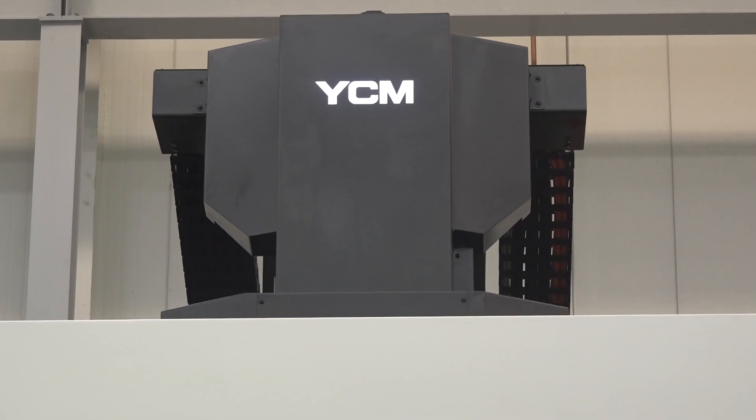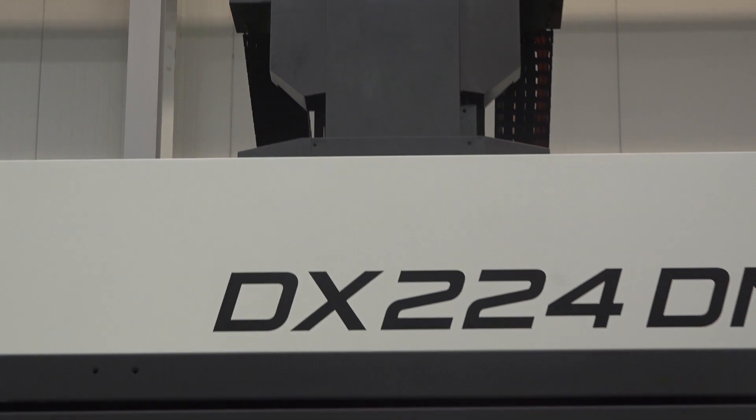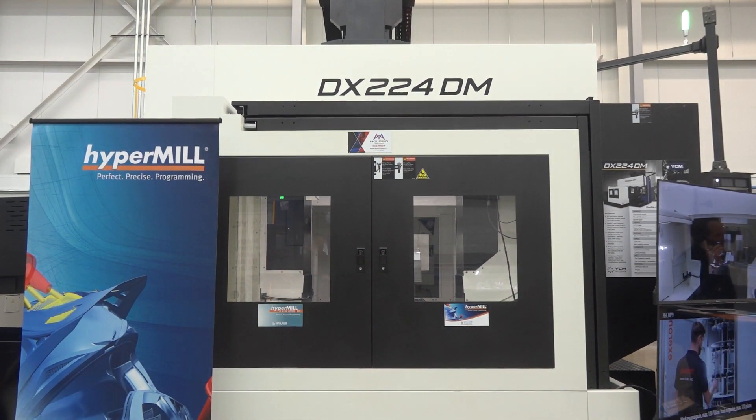I think it's all of the above. The value proposition here is longevity, the reliability of a YCM product. The head is a German-made product. We offer one built by YCM for aerospace with a five-axis HSK 63, and with an HSK 100, a 16,000 RPM spindle, we can go from roughing, semi, finishing — all in one. We're showing molds today, but this could easily be an aerospace component, a defense component, or a part production component. It's got a good size table, good load capacity, and the accuracies you'll see here are within a few tenths — the blends are perfect. It's a great overall machine, depending on the application.